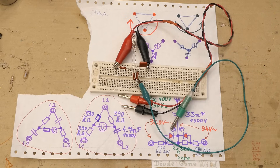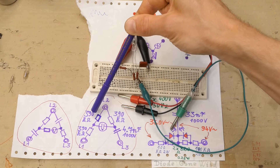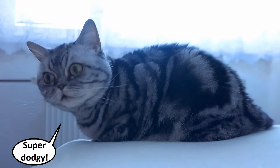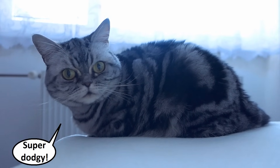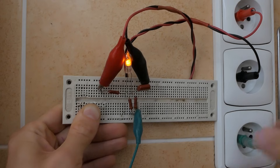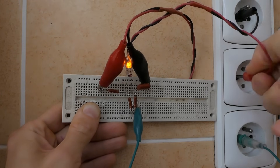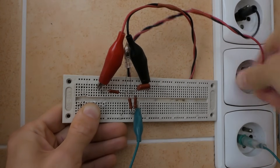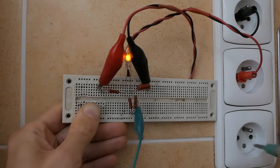Let's go back to the neon lamp circuit and test it. I'm using a 4.7 nF capacitor, so according to my table the resistor needs to be 390 kΩ. The divider isn't critical — they just need to be equal — so I'm also using 390 kΩ there. Again, three-phase mains on a breadboard. When plugged in one way, the lamp lights up and stays lit even if any of the three phases is missing. When I swap two phases, it does not light up — the phase rotation is the other way. If any of the three phases is then missing, it lights up, which indicates a missing phase. So basically only when all three proper phases are present does voltage cancellation happen and it turns off.